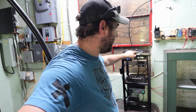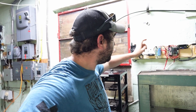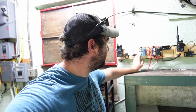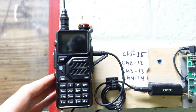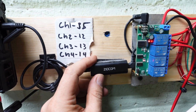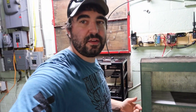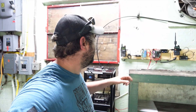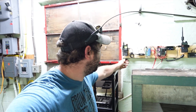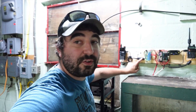All right guys, we've got our repeater right here — it is offline right now. This is our DTMF system. You've seen this before — this is the same board we just built at the house, identical in the way we built it. We're using this radio with a battery eliminator. If you're going to hook it up with a battery eliminator, you need to get one of these ground loop isolators. The power supply is very noisy and when you hook it up you're getting extra noise. The ground loops definitely help — that is a must.